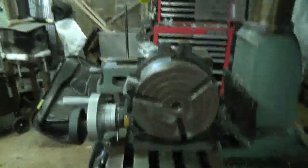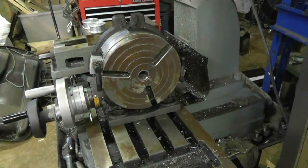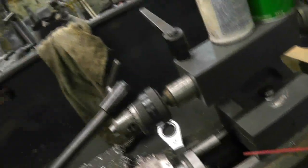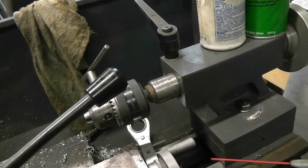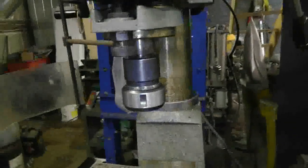I left off yesterday wondering what the taper is in here, and I looked it up — it's an MT2, Morse Taper No. 2 in there. Unfortunately I don't have any collets for MT2 types. The headstock in this lathe is MT4, tailstock is MT3, and the chuck is in a JT2 to MT3 adapter. I've got an MT4 to MT3 adapter and plenty of MT3 collets. The mill is an R8, but no MT3 or MT2.